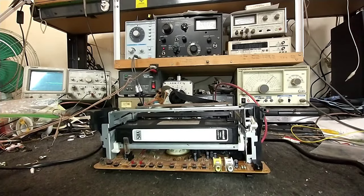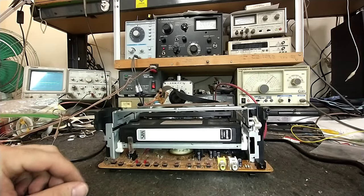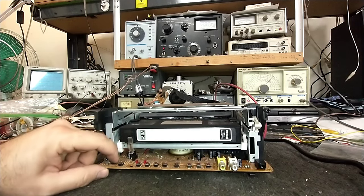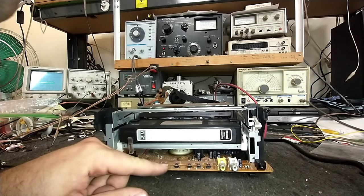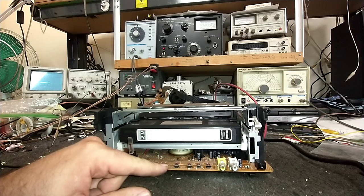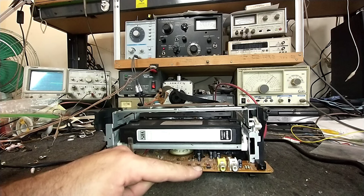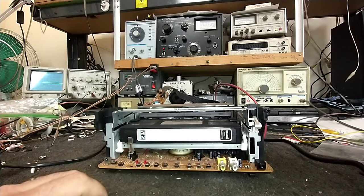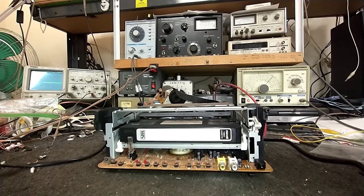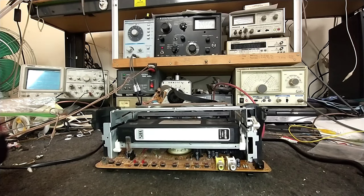Here's our main board with our VHS. So this is power, that's stop/eject, that's cue-up — or rather, this is actually play and this is stop/eject. We're going to get the ESR meter and test the tack switches, because it's a very good representation of loss in the switch. The ESR meter puts a tiny little signal that'll easily allow me to see if there's loss in the switches.